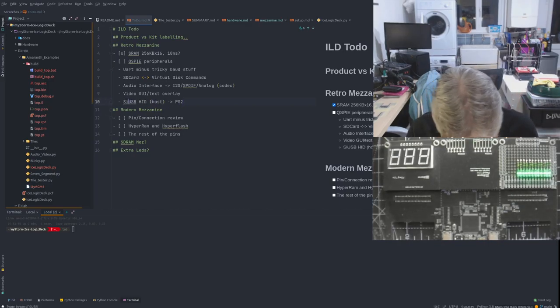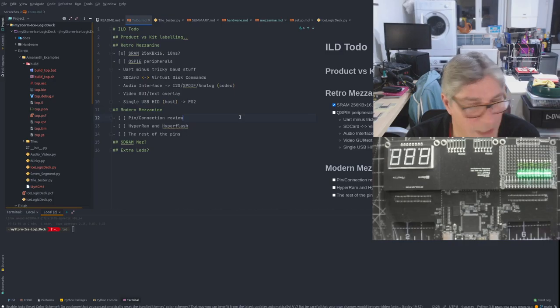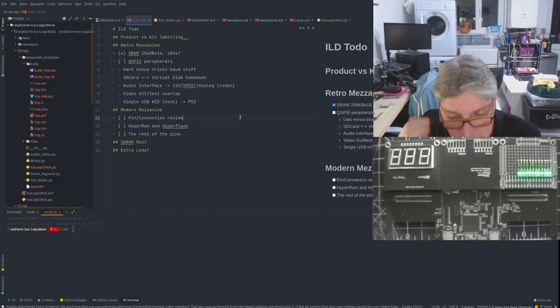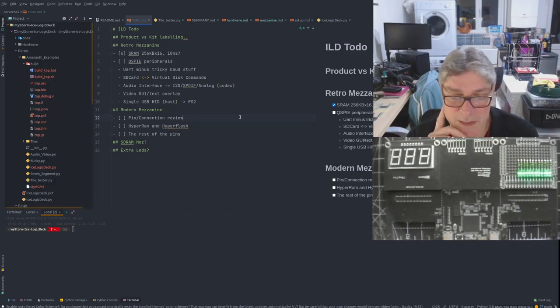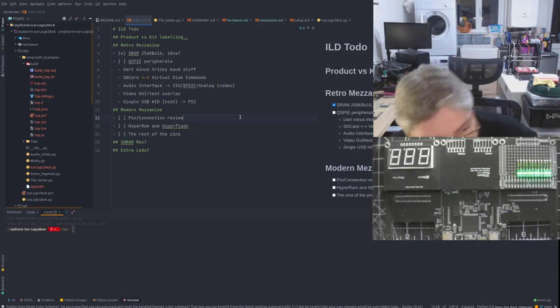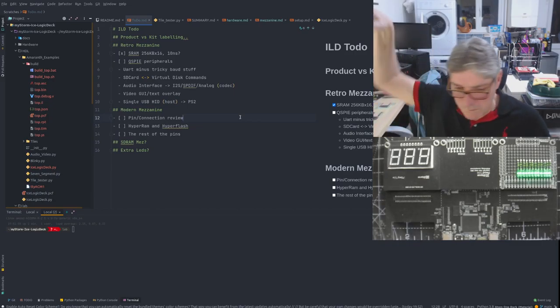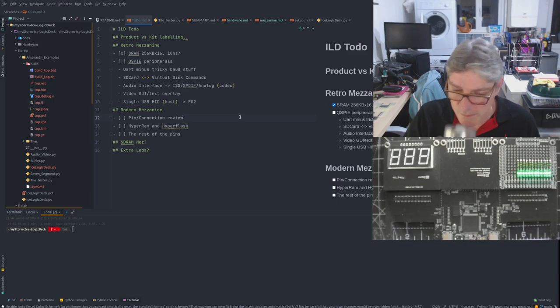Single, isn't it? Single. Beyond that, then it's a case of doing it on a tile that has some sort of expansion for gaming controllers, i.e. it's an add-on of some sort. In that case, there's no point in involving the STM32 because it's easier just to do it in the FPGA, right? You're not gaining anything, other than maybe saving some IOs.